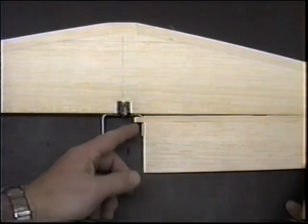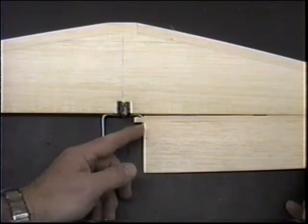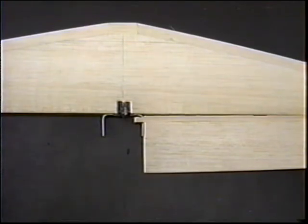I want to use that as the fixture, so I want to cut a piece of aluminum tubing next, get it all set to tack in place, and tack it in place before I do anything else.